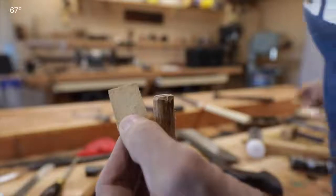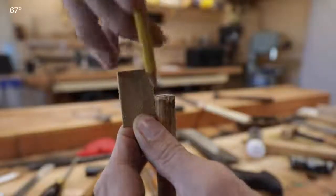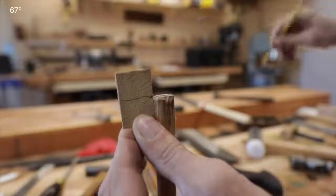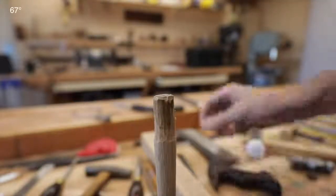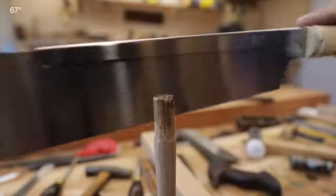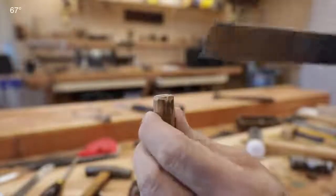Take a pencil and line it up right to the bottom — exactly where the top of the wedge is. You don't want to drive it beyond that point; there's nothing to be gained and you'll end up splitting the wood. Make sure you give yourself enough room for a nice proper wedge. I'll go right there — call that good.